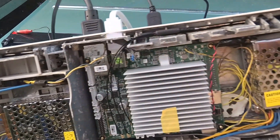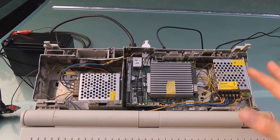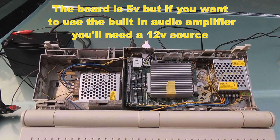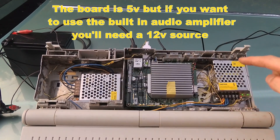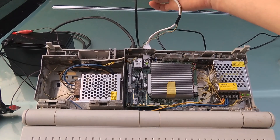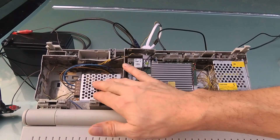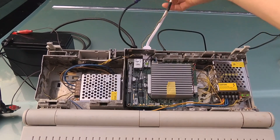A lot of videos don't have the power switch — your wires are right there for it. I have two power supplies in here because I ordered the smaller ones thinking they would be enough. This one is supposed to be a 6 amp 5 volt, and this one's a 4 amp. I have the 6 amp connected to the board to power it. I've also added a USB 3 hub — this power supply here is powering the screen and the USB hub.